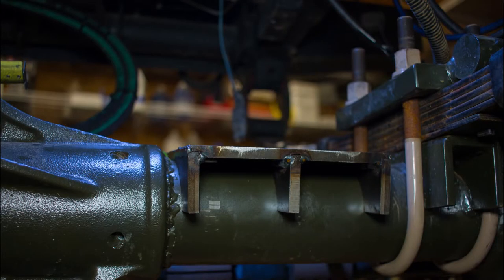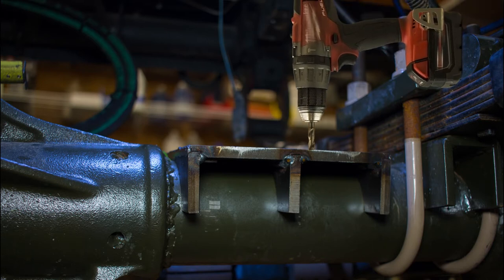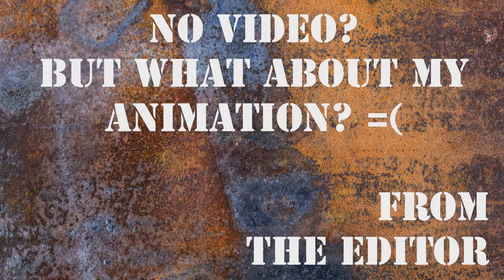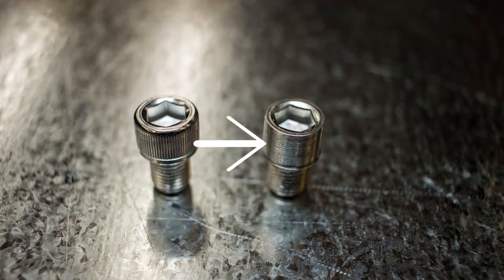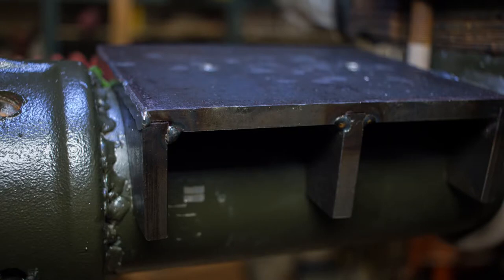So I need some way to keep the swing link from swinging around my axle tube. The solution is quite studly — literally, it's studs. I start out by drilling two holes into the base. With the base on the axle at the correct angle, I drill two holes into the axle tube using the base's holes as guides — which you can't see because there's no video, sorry. After tapping, I thread in studs, using leak lock to not only prevent the studs from backing out but to seal the threads, which will prevent water from getting into the axle tubes. The studs are simply socket cap bolts; I turn the heads down to a known diameter, and with the holes widened to that same diameter, we have a base that can't rotate around the axle.